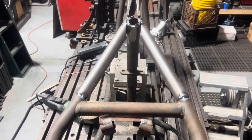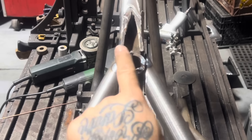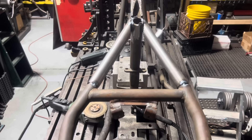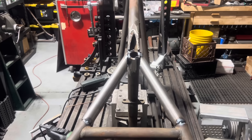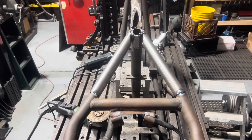The triangulated seat is all tacked up and I'm ready to finish weld it. I just wanted to show you how I take this frame and transform it - really give myself the ability to make a longer gas tank, make the bike look sleeker, make it look longer than it is without actually having to extend it. This is an old trick I've been doing for a lot of years. I hope you give it a try on your next custom.